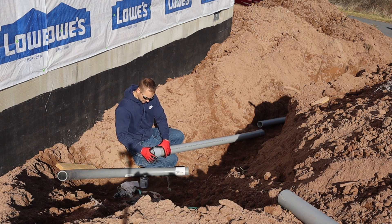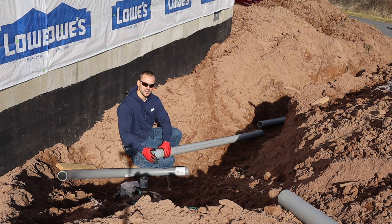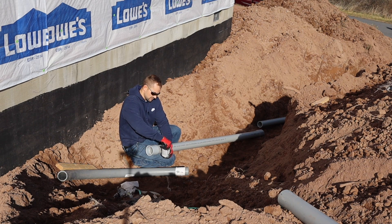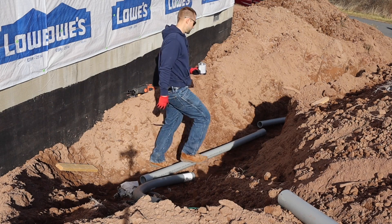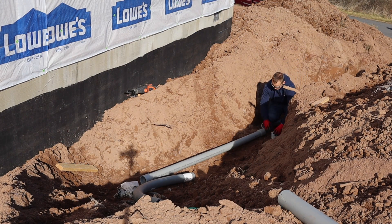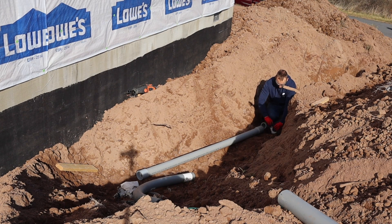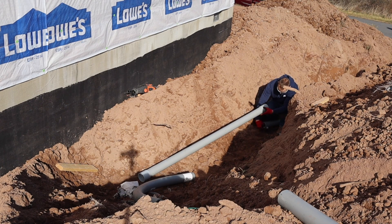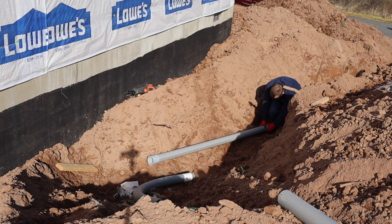Remember this is just conduit, so it's important to keep it water-sealed, but it doesn't have to be super clean when you glue it together. Just hold it together for a moment — it doesn't take too long for this glue to set up in warm weather. Now we come down to this end and glue it together like the other joints. Always get the dirt out first. The glue also acts as a lubricant when you go to slide the joint on, so it's really important to apply a lot of glue for ease of installation. Always give it a little twist to seal the glue around the joint.